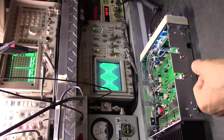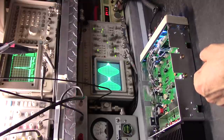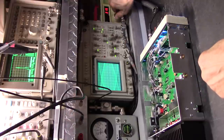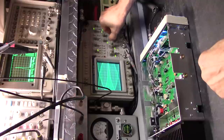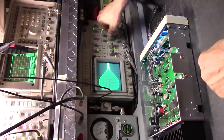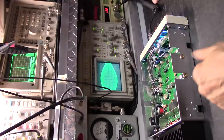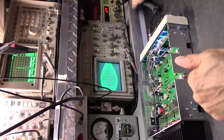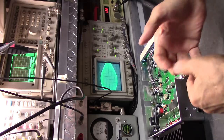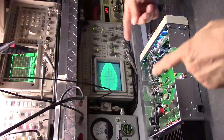Copy? Alright, so now we'll see a little bit more of the taper. Now let's drop it down. We're down to 315. Now let's take a look at this wave and see how distorted it is. Yeah, it's pretty decent, down to 169. And right now we're going down to like 130. That's pretty damn low for voice communication. The microphone that you use, etc., will contour that also. So there's a lot of variables involved in this, but this is what the radio does.